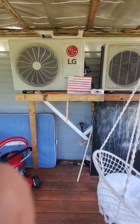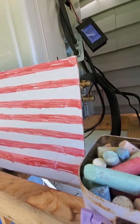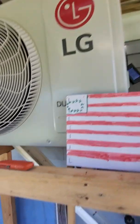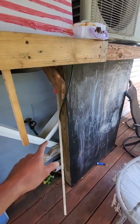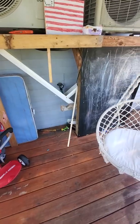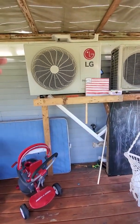Back to the unit — it's plumbed in just like a regular unit. You have your suction line, which is the insulated one; I'm not using it for AC so I don't insulate the liquid line. I just have a meter on it so I can see what I'm using. You will get a lot of condensation — you can see some still dripping. I have a gutter run-off just like my Fujitsu, and in wintertime I run a long drainage pipe all the way out so it's not rotting my deck posts. The mounting frame is a cop job — my brother-in-law helped me make the mock-up frame.